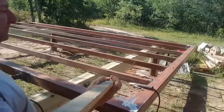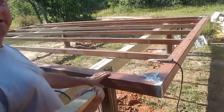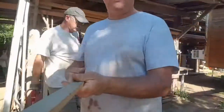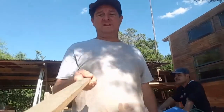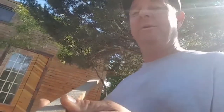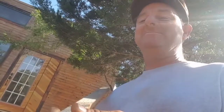We're two foot on centers with the one-and-a-half by three inch rectangular tube, 14-gauge red iron, and then the 11-gauge four-by-four. We took the cutoffs and we built them into the corners here — see if you can see that in the corner. That's our basic frame right there. We'll see you guys next week — keep following along. You're going to love how this thing comes out. Not only will you know how to build it, you'll know what it's made of. You'll be able to go and rent it and stay in it for as long as you'd like, and if you want to buy it from the customer we're building for, you can buy it at a great price. If that's not the one for you, there'll be three or four other ones to choose from as well. See you soon.